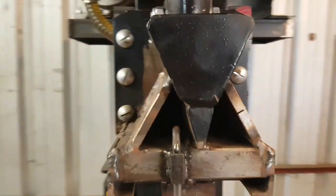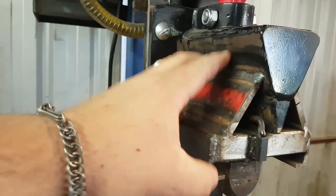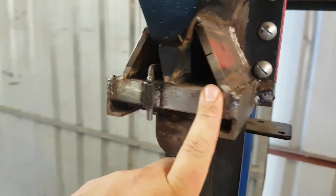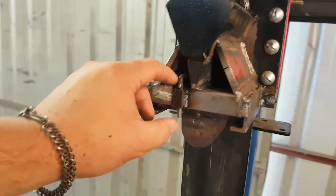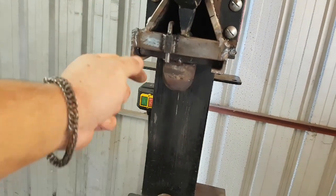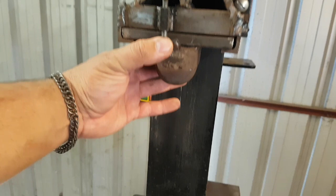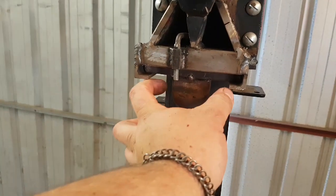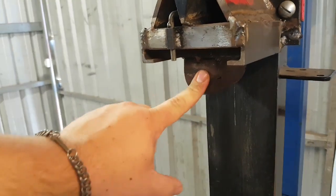The top die — we decided to just use the block splitter that was already attached. We welded these brace plates on so that we could support the inch-thick mild steel plate which is our top die plate, and that's fully welded around. We then welded on two little bits of angle iron to hold 12mm plate for our die plates. It has a gravity pin so you can just slide the dies out and in. There's an allowance for an 80mm wide die — these are 50mm round rounding dies, drawing dies.